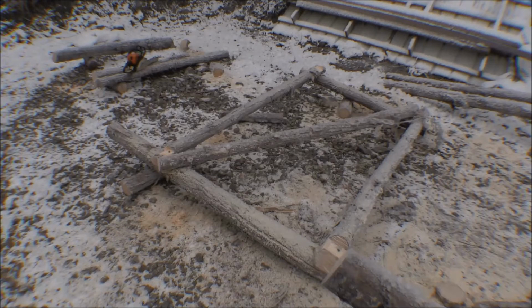I could take the time to run center lines down all of those and exact measure them out and everything. I'm not going to do that. This is just a rough construction. So I've taken and measured this upright here and put a mark on it, just a broad mark there at 5 feet. The other upright over there is 5 feet, and then I run diagonals between the two of them and got them within an inch or so of being a square, which, considering the taper in the wood and all of that kind of stuff, is actually pretty good.